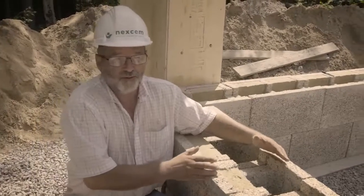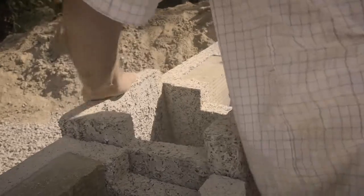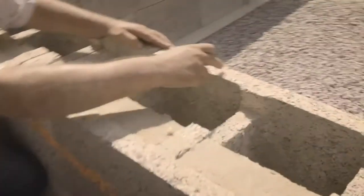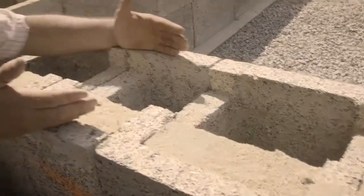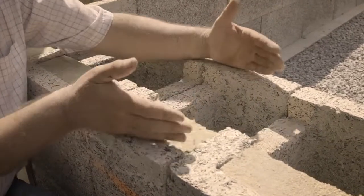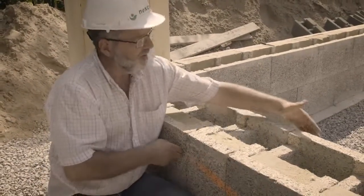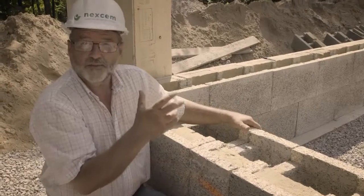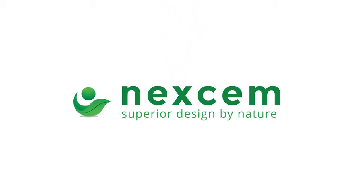This is one of the important things where we can actually run the risk of a blowout, and we have to pay attention. What can happen is we've lost the integrity of our cube. You can see in this one that we've got a cube shape and that'll hold the concrete when it's pouring in. But here we've cut that piece out. We've left lots of room for concrete, but now we have the chance for this wall to spread. So we'll put plywood screwing it across here and across here. We'll do that once our wall is up at the 10-foot mark and we're getting ready to pour — it's one of the last things before the pour.